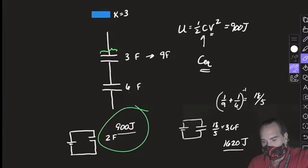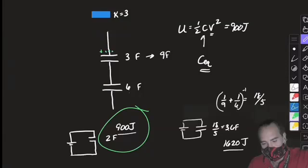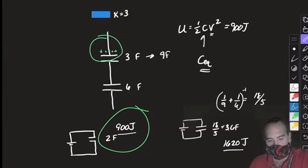We've got charges that were on the top of this capacitor. Say a bunch of positive charges here. When we go to put the dielectric in there, they want to change the electric field. They're going to push on those charged particles. But I can't draw any more charged particles from the battery. Therefore, I can't push these particles anywhere. They're not going to leave. There's no place for them to go.